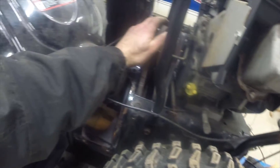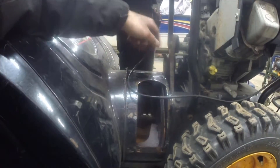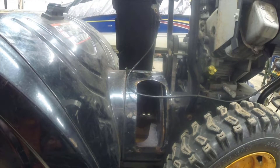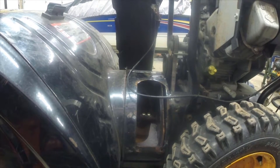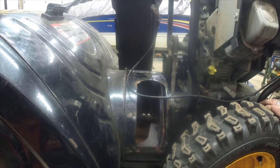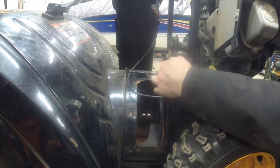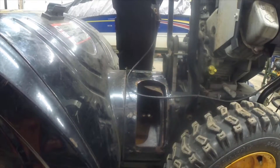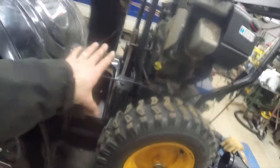It's not going to interfere with any of the pulleys or belt operation, so we're good there. To reinstall the belt on the engine pulley, it just took a little finagling — not easy with one hand — but it slips back on over the engine crank pulley without any trouble. And now when I squeeze this one, that engages the auger. So we're back to where we were with this shroud all repaired and welded back in place.